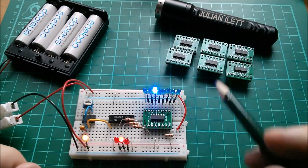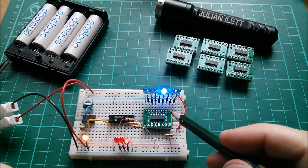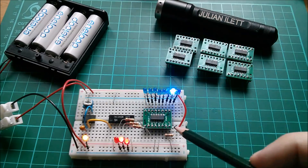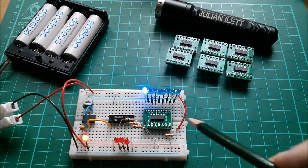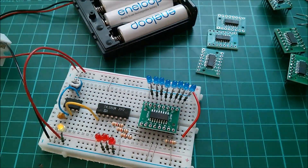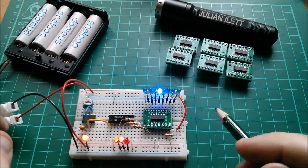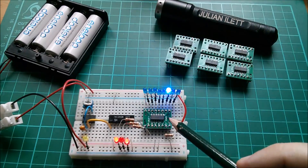So one of these seven chips I soldered the wrong way around. When I put it into my breadboard following the legends on the printed circuit board, I fried the chip because I had VCC and ground the wrong way around. It smelt bad, smoke came out, a little heat blister appeared. Let's pop it in — something's not right... oh, that's frying, yeah, that's getting hot. Let's switch that off right now. That looked pretty terminal; I thought I'd cooked this chip and it would never work again.